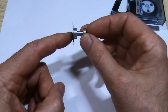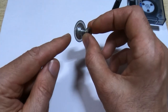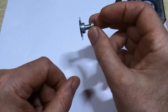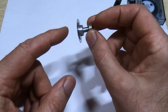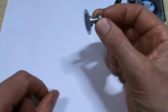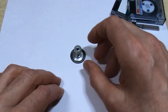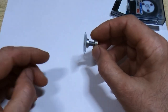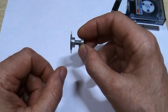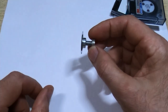There's not really enough space to get a dog of any sort on this. In particular, this is a very delicate thing — the wheel is bonded to this part so I need to be very careful not to damage it. That's one of the main limitations here. If that weren't bonded on I'd actually machine an entire new part. The way I intend to mount this in the lathe is to make a spindle adapter, machine it in position, then slide this onto it, use the grub screws to secure it, and it will spin true as it does on the motor spindle.